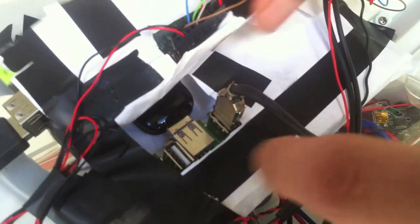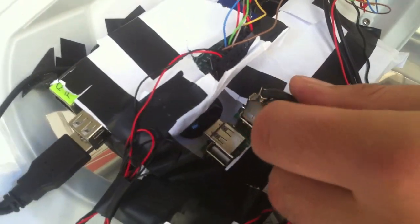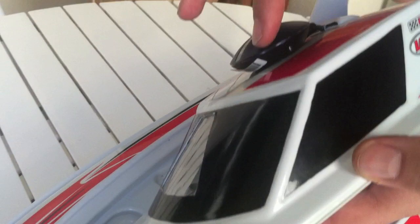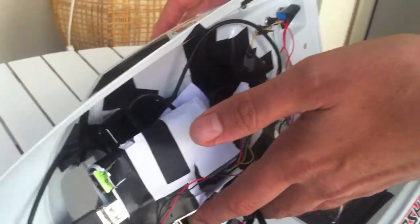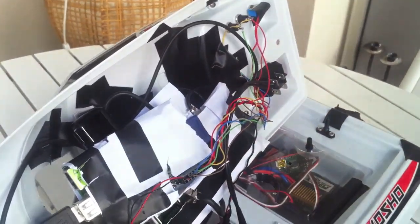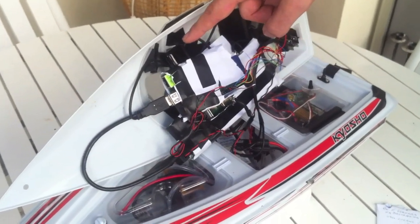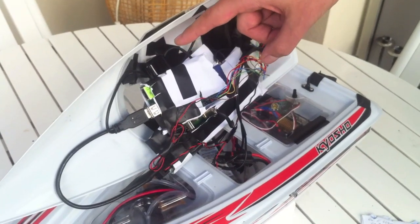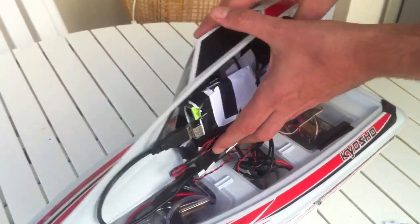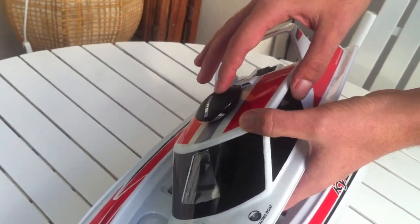There's a 3G modem. This is the connection to the servo, and we have connections to the GPS and the forward-facing camera. The 3G modem was actually one of the hardest parts to get working. We have the config script up on GitHub if you want to download it. The GPS is accessed directly by a node, so it just emits events whenever you get some data.